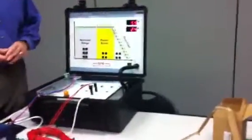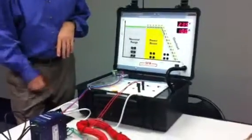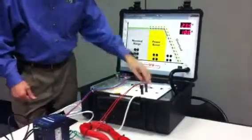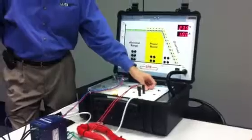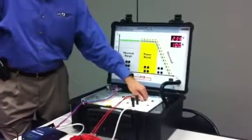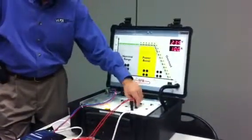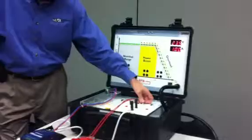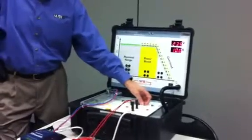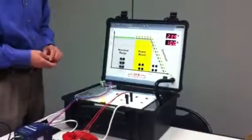Okay, everything crashed without warning, and we don't know anything happened until you see the red lights on the power supply. So this power supply just took itself offline. Very finally, that breaker just tripped after all that time. But I don't know if that was probably because the thing's overheating. It's running short through that breaker all that time. So that's what happened. The breaker won't even reset. There you go. It had to cool down to reset because that breaker had that short on it the whole time. Thermal load. So you're still in the short.